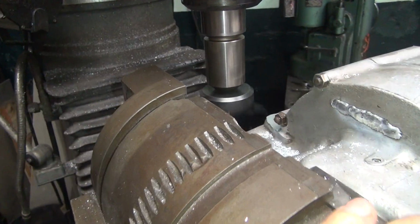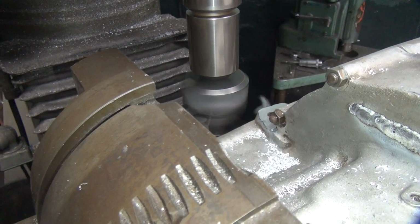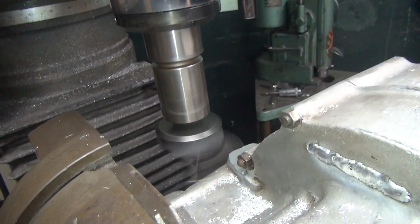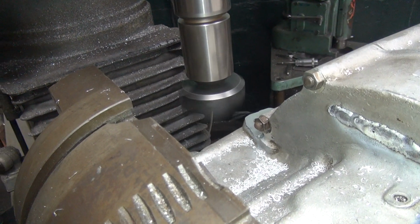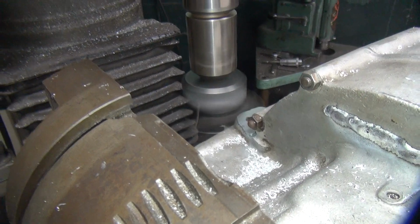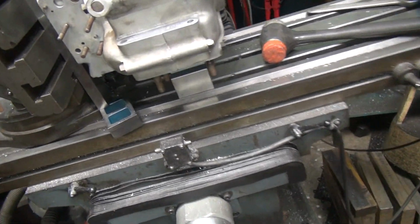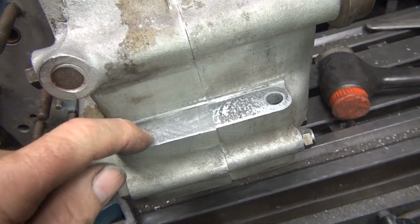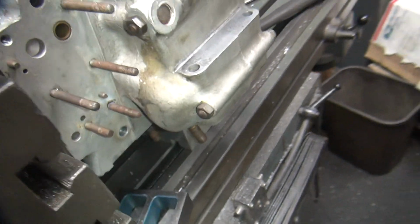Yeah. So you've got climb milling and conventional milling. So it must be a little bit of a climb going the other way. Well, there's a better finish. Climb milling is a better finish than standard. This should be a better finish out this way. But for some reason, I don't have all these rough machine marks like they did here. It doesn't look like that on my surface.